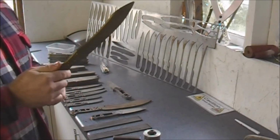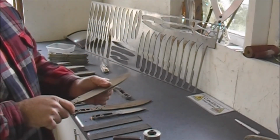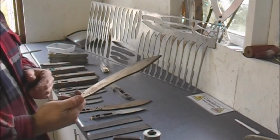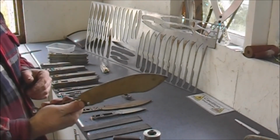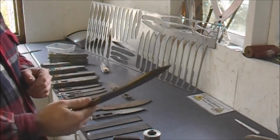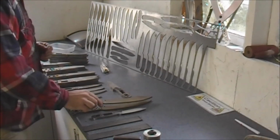These ones I've re-tempered at home to take them back down to the mid-50s, and I'll put a full flat with a nice convex on these, I think. Good strong edge on it, and see how it works, just as an experiment. So there's 2 there to play with.